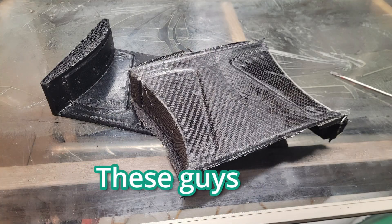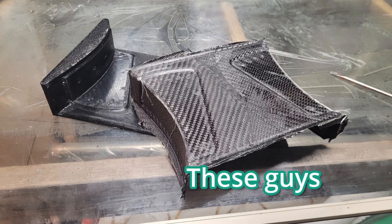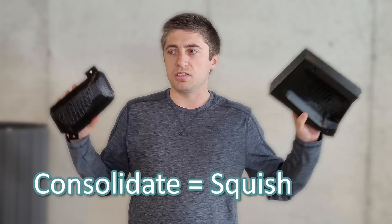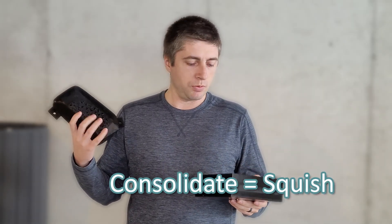I'll feed the carbon in, put resin on it, and compress it down. That takes the place of vacuum bagging — under compression it's still applying pressure and squeezing out excess resin, so we don't need as much post-processing concern. This is set it and forget it. Clamping pressures don't even need to be that high, you just need the fibers to consolidate under each other.